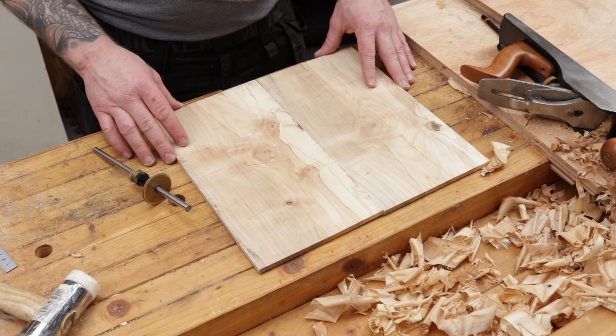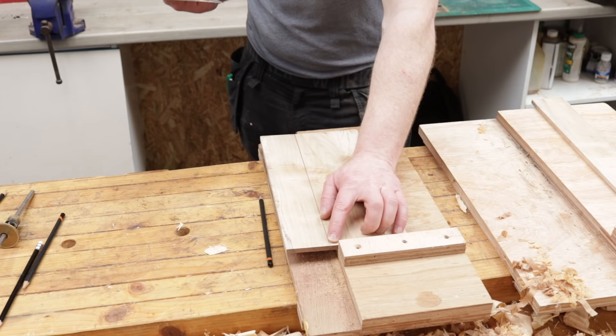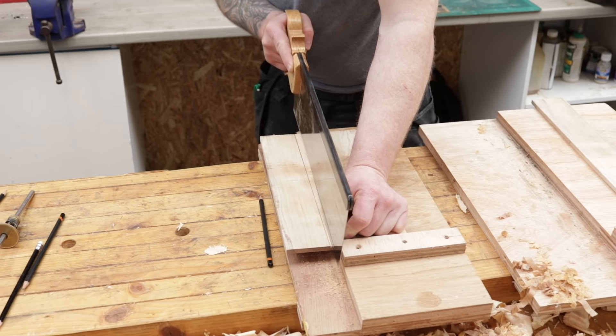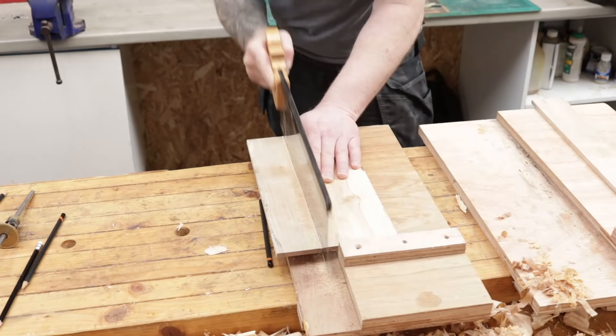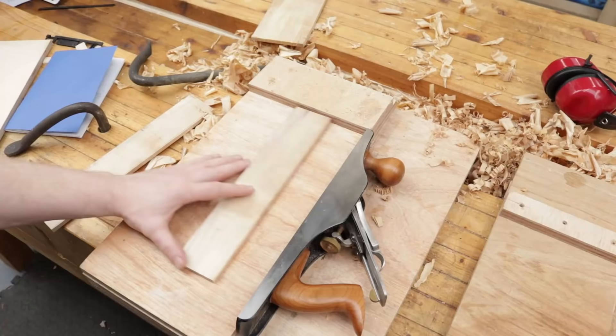We want to cut the pieces and square them back up, then put a miter on the edges. I'll use the big tenon saw, cutting a couple of millimeters away from the line. Depending on how good you are with a saw, the closer you get to the line the better. I'm going to stay back about three millimeters and work through to the line on the shooting board — that's the beauty of the shooting board. We can give ourselves a little bit of leeway.